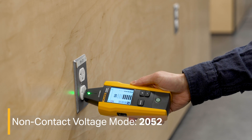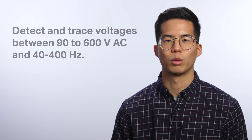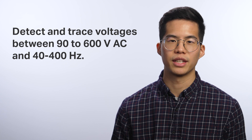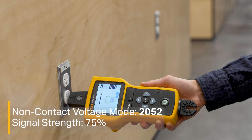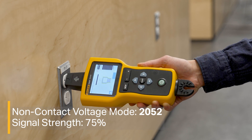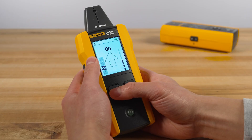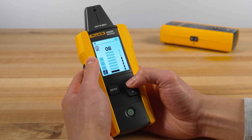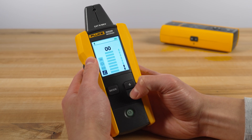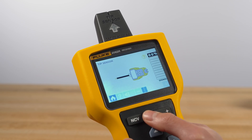Non-contact voltage mode allows you to verify that a wire is energized without the transmitter. The receiver will detect and trace voltages between 90 to 600 volts AC and 40 to 400 hertz. Scan the target area with the tip sensor to find the highest signal level. Keep the tip sensor perpendicular to the wire and the groove parallel to the wire, aiming for a signal strength around 75%. If a signal is detected, the bars show black proportional to the signal strength. If no signal is detected, all of the bars will be gray. Increase or decrease the sensitivity to identify the line or phase wire from the neutral line.